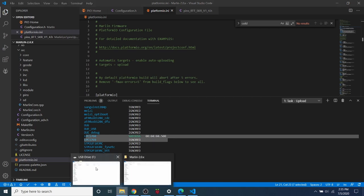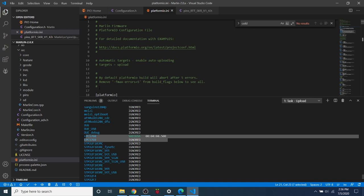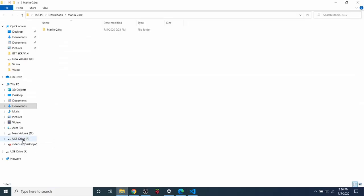Clicking on the USB drive, we have our firmware.bin ready. To load it, I'll remove the USB drive and reconnect it — this loads the firmware via USB power at 5 volts. We should get a pop-up shortly confirming the firmware has updated. Clicking on the drive confirms it now shows firmware.cur with a current timestamp, confirming successful loading.